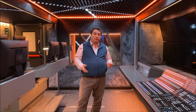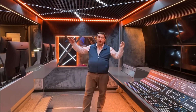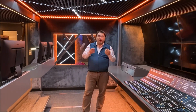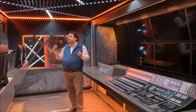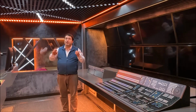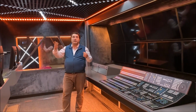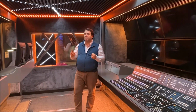We are using birch plywood in our raised floor, as well as we are using again the same birch plywood in the walls inside. So this is like the highest grade plywood in terms of durability and strength that you can buy. So that is one of the reasons why we don't need to hide so many mechanical support structures inside the walls in case you want to hang something. The wall inside surface, that 10 millimeter plywood, is a very good load carrying material.